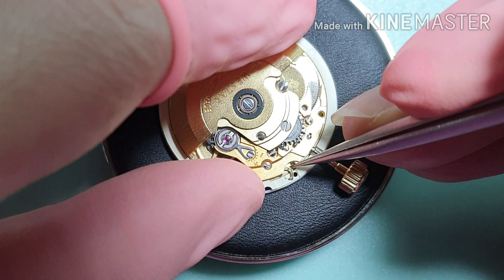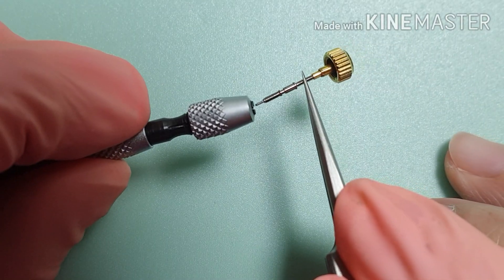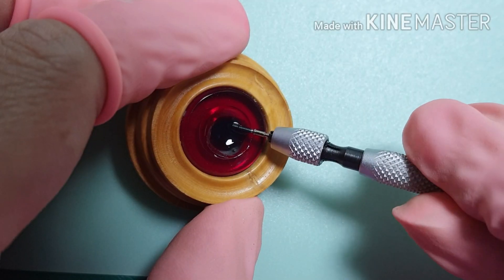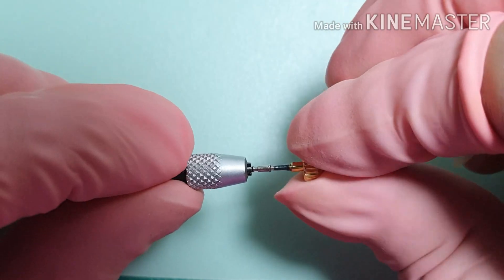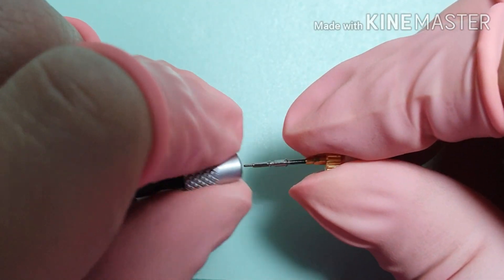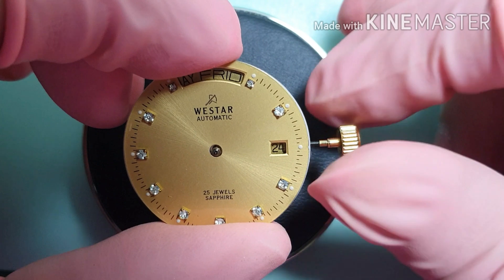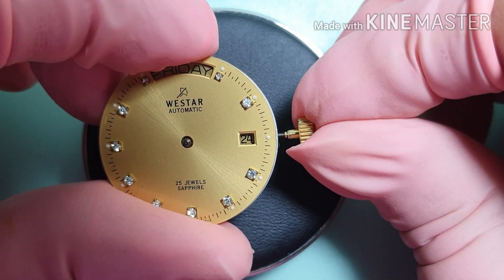Release the dial fit lock and now I fit the dial. I'm putting the lock tie to secure the stem and the crown. I use the rodico to clean up a bit. I am checking the operation of the quickset and the day-date change. It seems like I need another video because I have to fix the balance wheel problem.